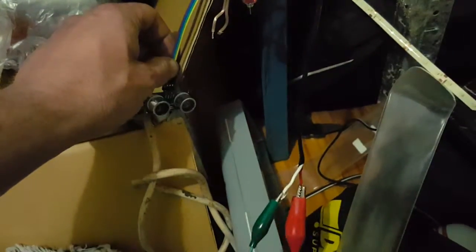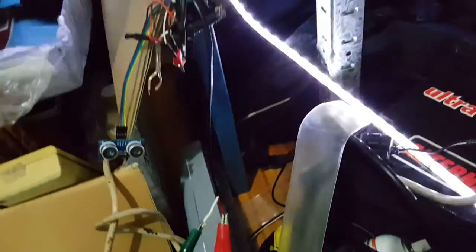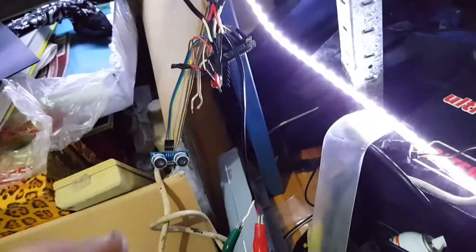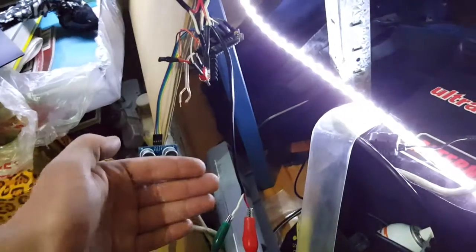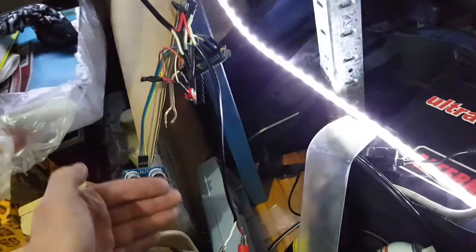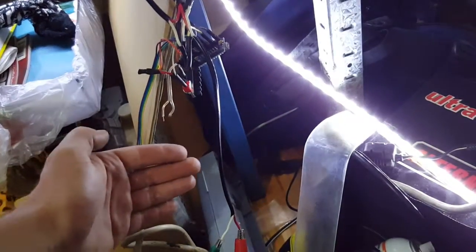In the next mode, the ultrasonic sensor pair activates the lights — when something is 50 centimeters away they're off, then it starts fading on, getting brighter and brighter as it gets closer and closer. I also added code so it fades on and fades off smoothly.